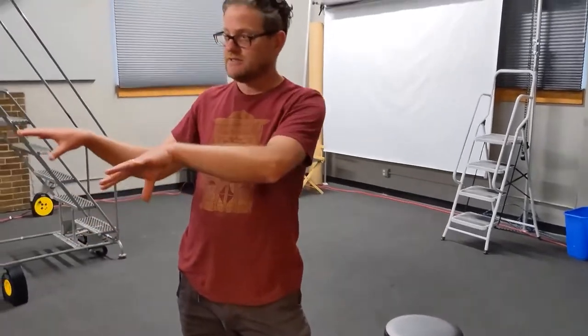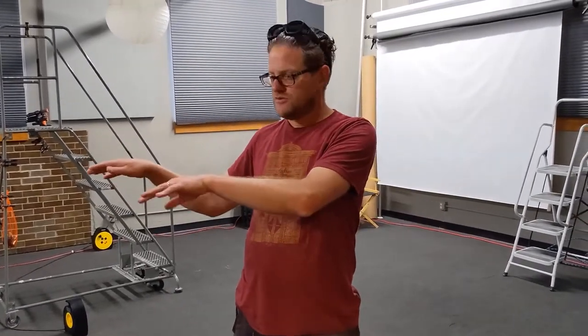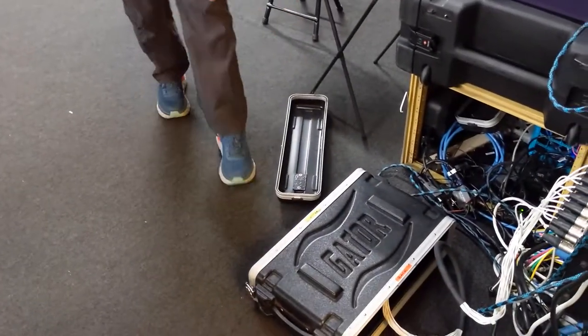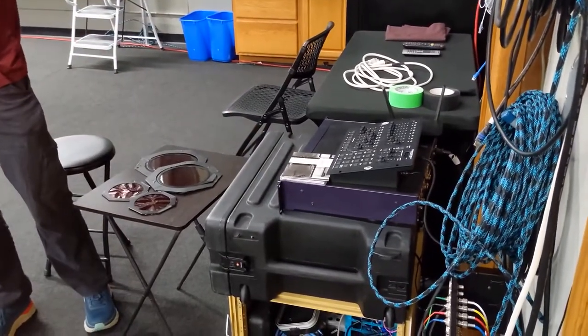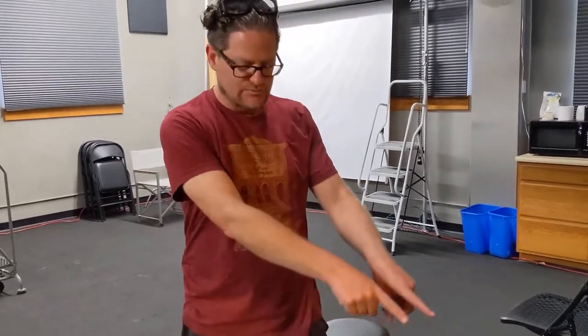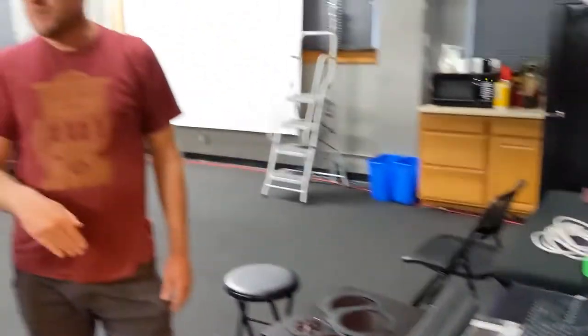For example, during the SoundCloud sessions last Saturday I had eight microphone inputs up here on the stage. Each of those eight inputs came in to the splitter, the direct output came to the console so I could mix the live sound — I had nothing to do with recording at all — but those same eight mic signals went downstairs at the same time via the splitter and were patched in so they could be recorded simultaneously.